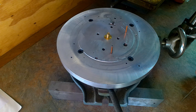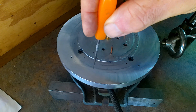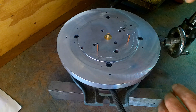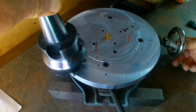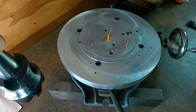It was fitted such a long time ago I don't think I machined it on the lathe to diameter — I think I just bolted it on roughly bandsawed. Of course, once you've mounted the rotary table, you can mill around the edge with an end mill and wind the table around. When you're ready for the top surface, something like a shell mill is ideal — rotate it around while winding the table, and once you've been all the way around just keep going, slowly winding in X or Y until you reach the center.